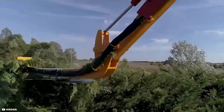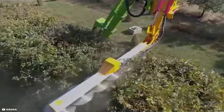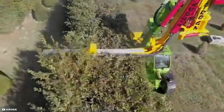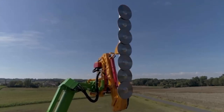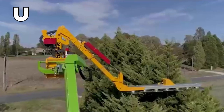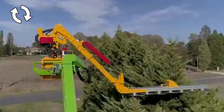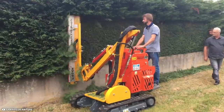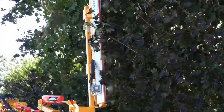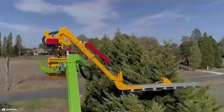But the Kirigan beats everyone else when it comes to enormous trimmers. This massive gadget weighs a stunning 1,550 pounds, making it a drivable trimmer — since only the amazing Hulk could utilize it as a portable instrument. The Kirigan, which has seven stainless steel blades, is made to cut through 82-foot-tall hedges. The retractable knives are kept back against their core discs by magnets while not in use. The blades move forward in an ideal cutting position as soon as the disc begins to revolve. These rotating blades may then go through the top of the hedge and offer a level finish. However, the THA 700 model can be used if you need something a little smaller — this self-propelled cutter can reach a height of 22 feet. The Kirigan machine is an incredible feat of French engineering.